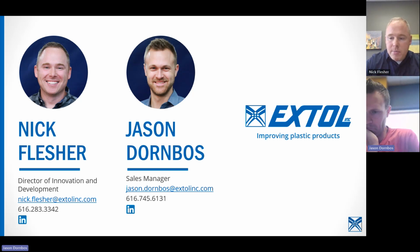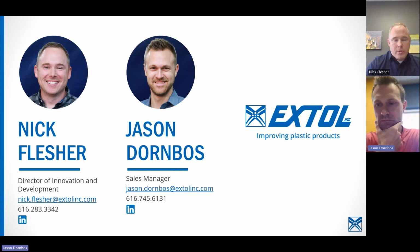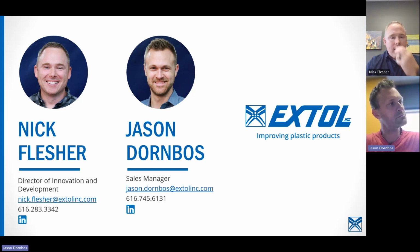We had a question about metallized components. If it's purely metal to metal, we don't play in that space. The wavelengths are different, the powers are different, the focal points are different. Our specialty is plastic welding. However, if you want to embed metal into plastic, we can do that. Sometimes we use conductive materials. We have a smart heating technology that we use for that, where you can heat up and cool down in a little cycle. Sometimes it's laser, but we find the laser is a little too energy dense to do embedding really successfully. Sometimes you have to pre-treat the plastic. So I would say that's a separate conversation.